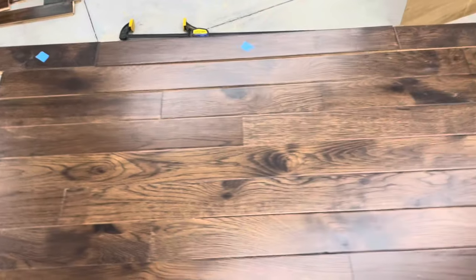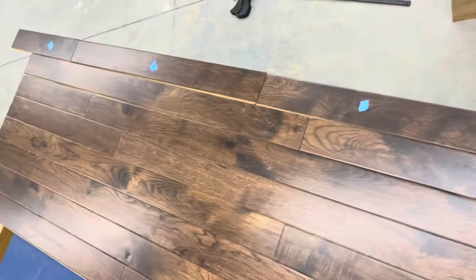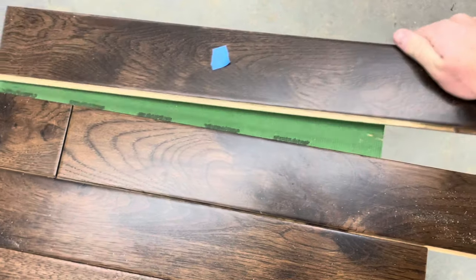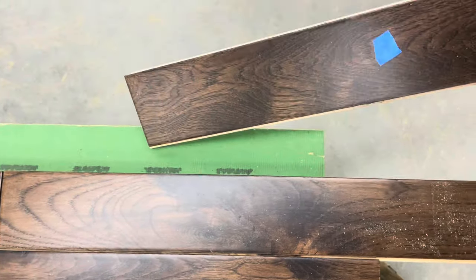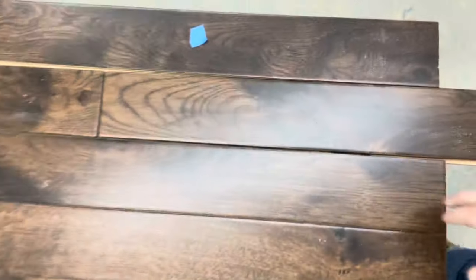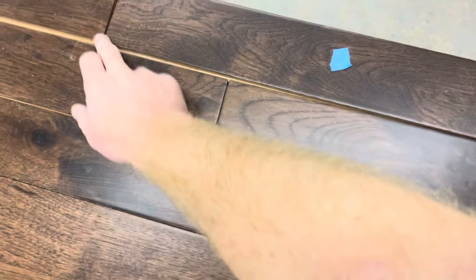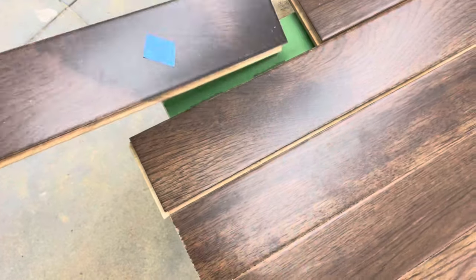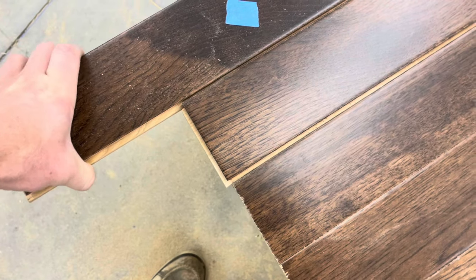I have the final two rows measured out but not put in place. The reason I have it like this is so this piece will not be attached — I can screw into the plywood and into the studs, then just slide this piece in perfectly. The issue I had was just trying to make the seams not be right on top of each other. On this side would be the same concept — I have a little room to screw into some studs. It'll look like a complete wall, but when I want to remove it, I'm able to.